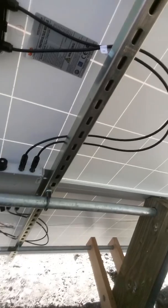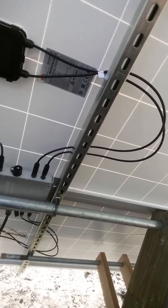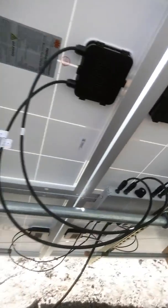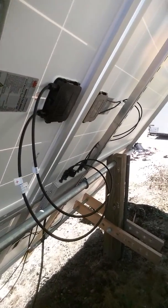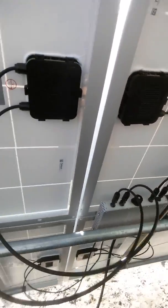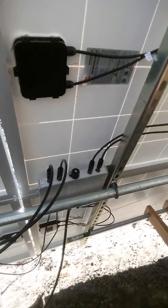So effectively we're getting about 225 watts per panel. It varies depending on the temperature and time of day, but that's about what you're going to expect with a little bit of loss — they're not going to ever generate the full 290 watts. I'm really pleased with how these work. You can tell when they're functioning at peak because they hum a little bit, and they do get really hot to the touch — you could almost boil water on them.